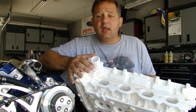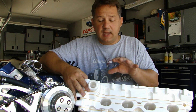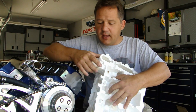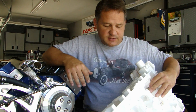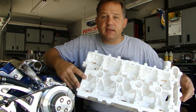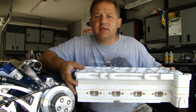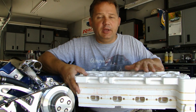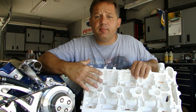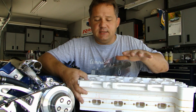This is how this works. The part is made out of foam — a very precision foam used for this method with a very specific density for the beads. You can see that the top of the cylinder head, the exhaust side, the face where the valves go, and the intake side — everything is exactly as it would be if you were to look at a finished machined cylinder head. This would be the raw casting. This is placed in the mold and packed thoroughly with an extremely fine casting sand. Every one of these openings, every one of these little voids gets filled with a very fine sand.